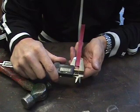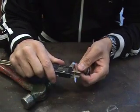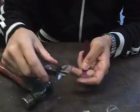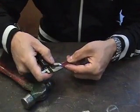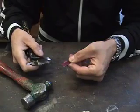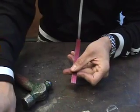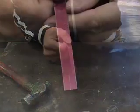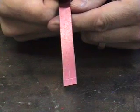This should be 0.500 or half an inch, so this is a little bit undersized. I'm going to compensate that — divide by 2. 496 divided by 2 is going to be 248. I'm going to lock that screw and go easily one corner to the other. If I want to check this on the width, I go one jaw there, slide it across, and compare by doing the same on the opposite side. The intersection of those two lines is where your prick punch mark is going to go and where your hole will be located.